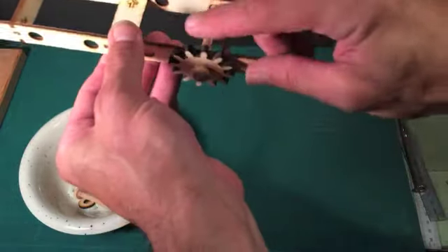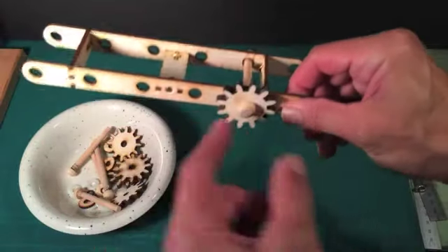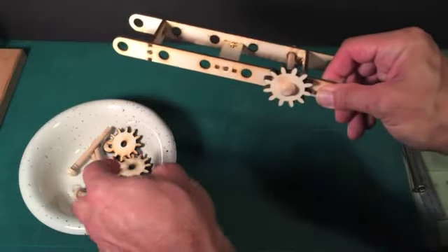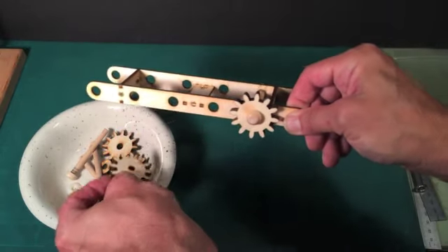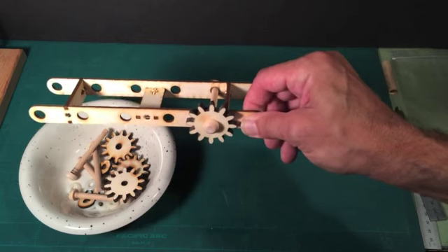Follow it up with a wooden washer, then one of the O-rings. The O-rings can be slid on — it helps if you have some fingernails — you can roll it down the shaft. To properly seat it, use the smaller hole of the insertion tool and push the O-ring down — you can even twist the insertion tool a little until the O-ring is fully seated. You'll notice the gear spins nice and freely. Now we're going to populate all three remaining holes with the gears, making sure they mesh with each other. Put all the gears in place and then we'll go to the next step.